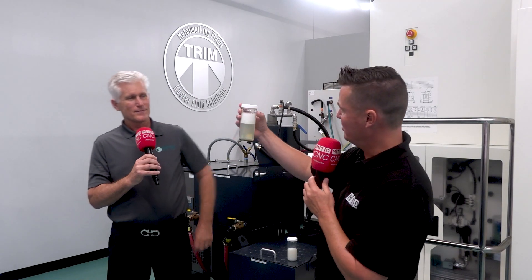The old coolant is actually getting worse as all the air slowly works itself out of the fluid — it'll stay that way for about 7 to 10 minutes. If you're constantly running your high-pressure system, that foam just keeps building and building until it comes out of the machine. That product isn't bad — it's just not designed for that new application.